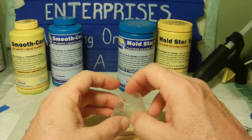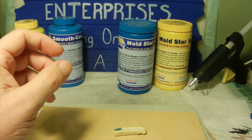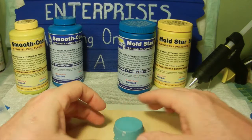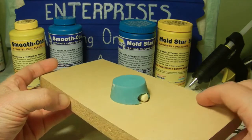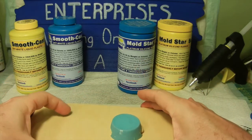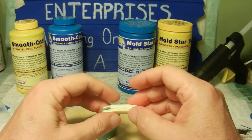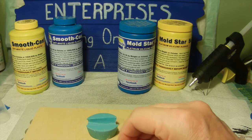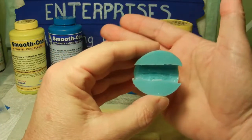Once that was done, I took apart the plastic cup from the base. After the mold cured for 30 minutes, I pried it off the base, peeled back the clay, removed the shotgun and the toothpick — and that's our first part of the mold.